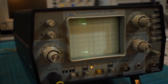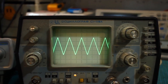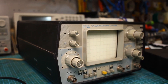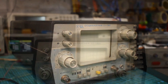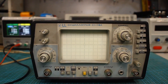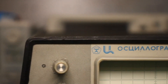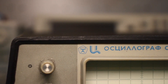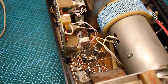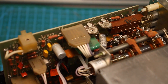What kind of display is this? It's a cathode ray tube — 11EL09N, 6 by 8 centimeters. Filament voltage is 6.3 volts with a current from 80 to 100 milliamps. Anode voltage is 8 kilovolts. The input resistance of the oscilloscope is 1 megaohm. The device weighs 4 kilograms. It was manufactured in 1990, and contains almost no precious metals — but refiners destroy working devices even for a much smaller amount of precious scrap.